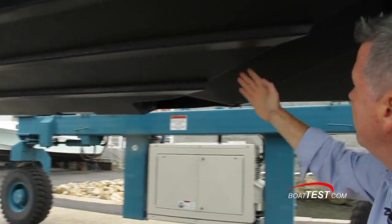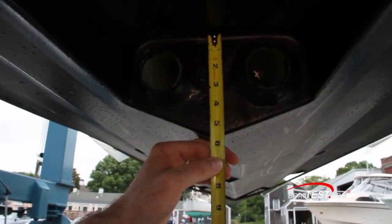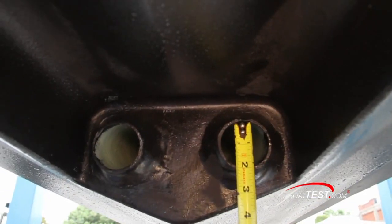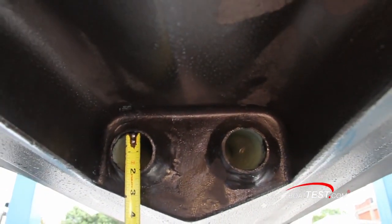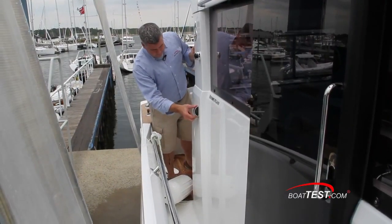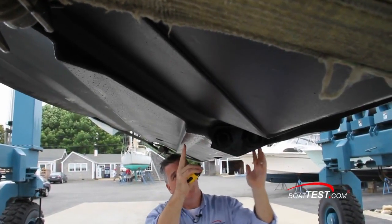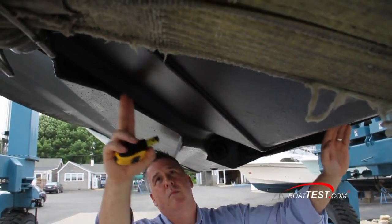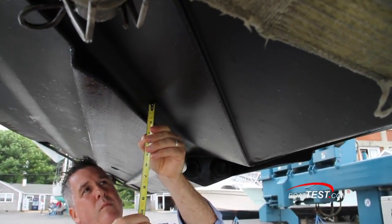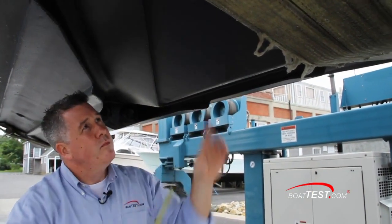Here at just about two thirds of the way aft, we see the major features of the AirStep design. We have a five and a half inch cutout which is the location for the twin two inch ducts where the air is introduced. The air is drawn in through these small ports located about 36 inches off the deck on each side of the pilot house. Back down at the hull, aft of the air ducts is the control area, which includes a two inch recessed step outboard and a smaller three quarter step inboard, which defines the low drag running surface.